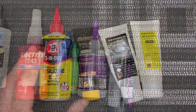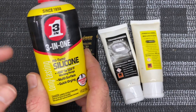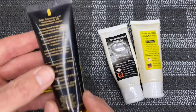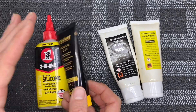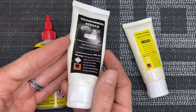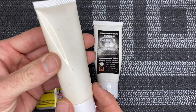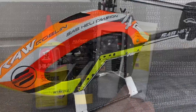You're also going to need a variety of greases. I like this three-in-one silicone oil — it works great on all your rubber like O-rings for your canopies. Micro Lube GL-261 is hands down my favorite grease for everything: head dampeners, shims, bearings, all of it. There's also transmission modular grease which is really only for SAB models. And one-way bearing grease — this works for all helicopters, so get yourself some one-way bearing grease and it will prolong the life of your one-way bearing.